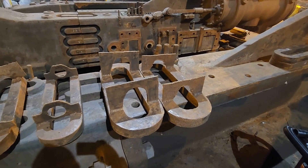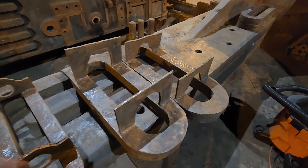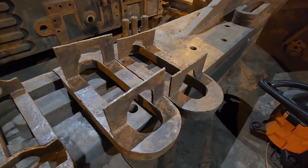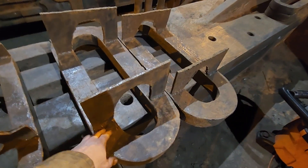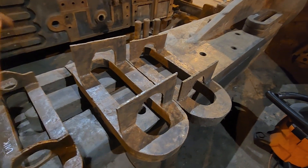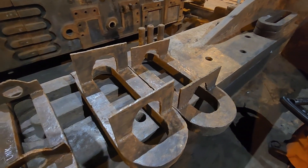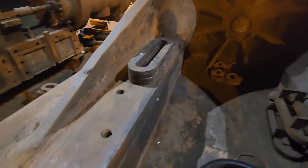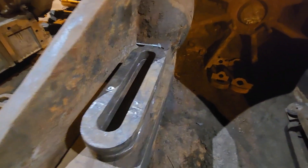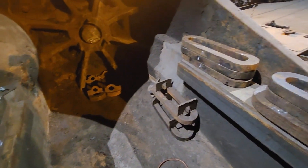What I'm doing here with the shrink links — you'll see some of these have pieces of plate welded on them. When the riggers tore the machine apart, they welded these pieces on to make it easier to pull the links out: they'd heat them up, attach a chain, and pop them right out. So I'm going through and cutting all that stuff back off, since it shouldn't be there, and getting the links cleaned up and ready to go.